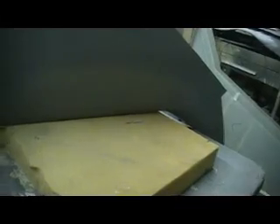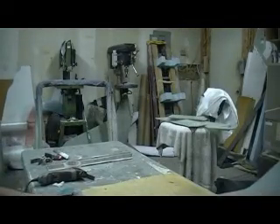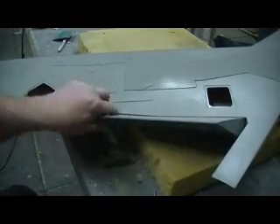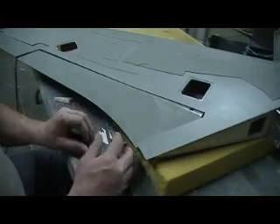There's the top - you're gonna see that, there we go. Nice gapless hinge. See how far that's traveling? You see how far - you know why that's traveling that far? Look at that deflection. You know why that's traveling so far? Because that's hinged correctly. I've seen a lot of guys mess those hinges up, and it's really not that difficult.